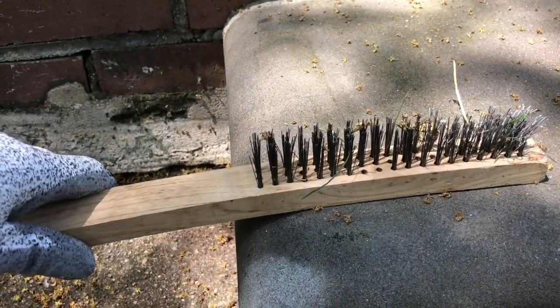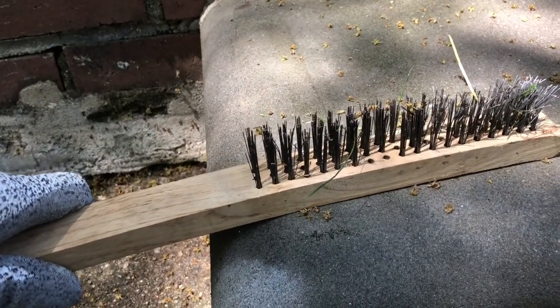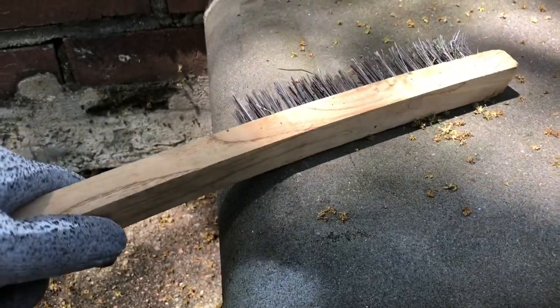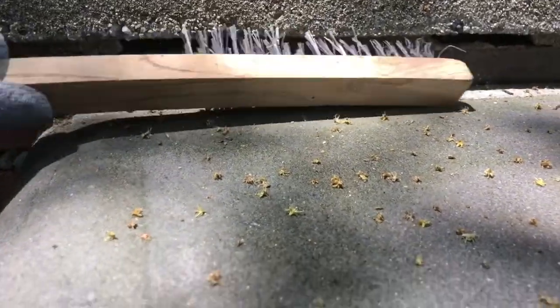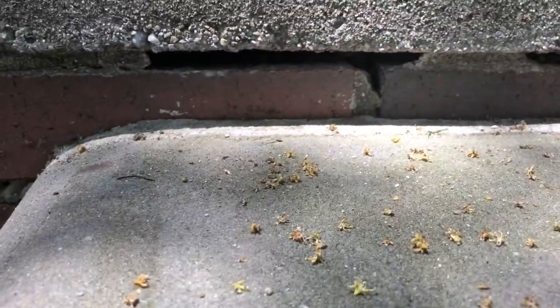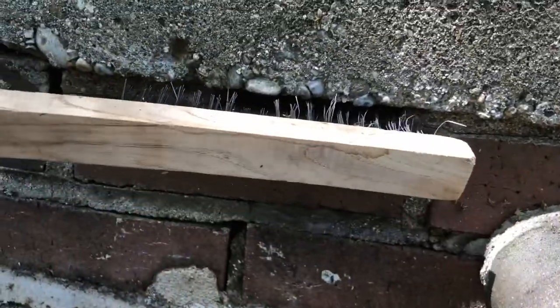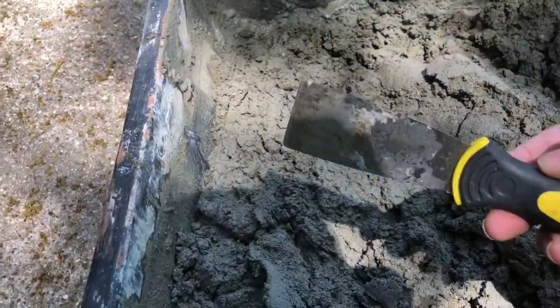The main tool I'm going to use is this wire brush. I also have a trowel-type tool to clean it out. Once I get the initial debris out, I'll come over with this and get in there — you can see the dust flying. You just want to clean it out so the cement has something to stick to. You don't want debris in there, otherwise it'll come loose and take your concrete with it.